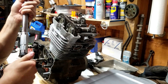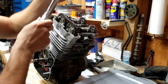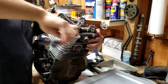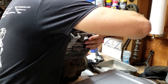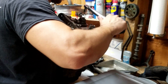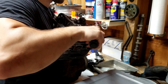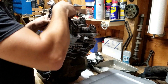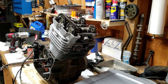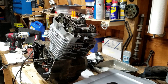The cam cap bolts are 7.2 foot-pounds or 86.4 inch-pounds — I'm going to do 86. At least they're not stripped because they used to be mostly stripped. This is literally the first time I ever torqued the cam cap bolts with a torque wrench — the reason this bike's probably been so unreliable. I'm trying to improve. They spin pretty nice. I totally just realized I forgot to put in my timing chain guide like usual — I always forget to put that in.